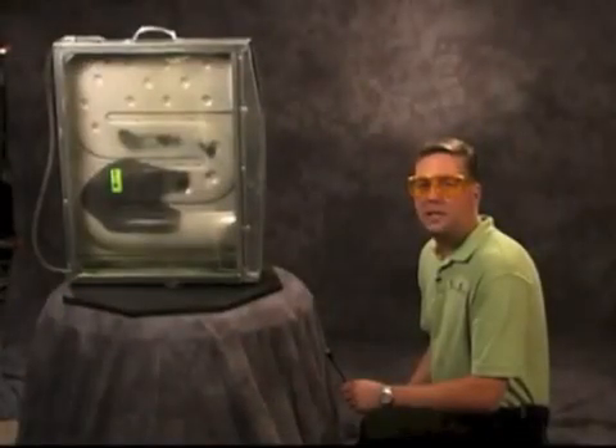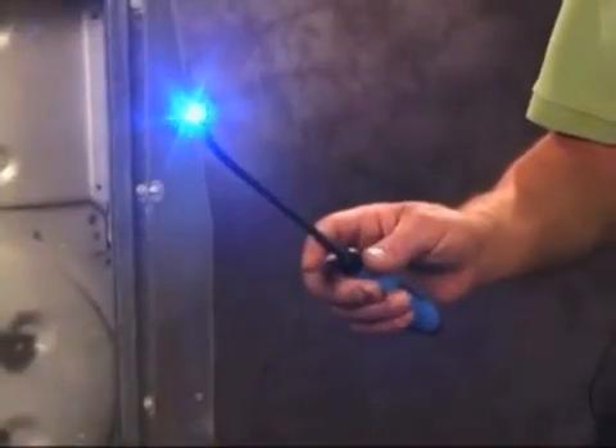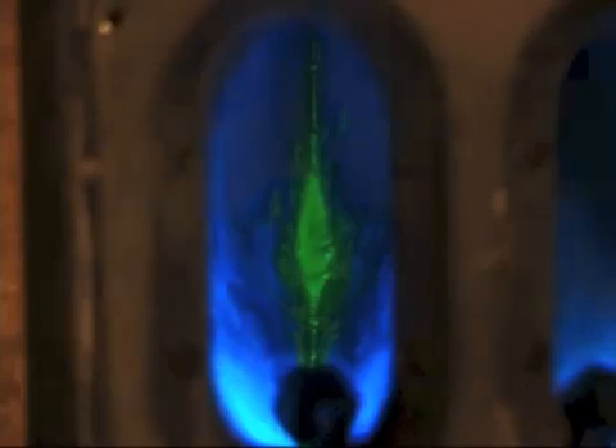Once you've saturated the air side of the heat exchanger, take your blacklight flashlight and look at the combustion side of the cells through the burner openings. Any evidence of the green dye penetrating is evidence that you have a crack or hole that needs further investigation. On some modern crimp-style heat exchangers, a very minute amount of dye will penetrate through the seams where the two halves meet — this is normal. Any excessive dye or flooding of the chambers would indicate a much more serious problem: a hole or crack.